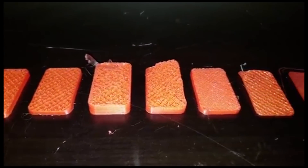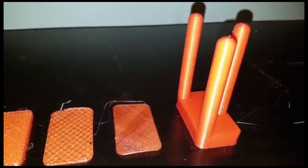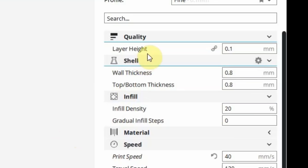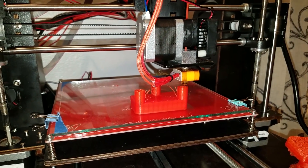I'm typically a pretty stubborn guy, but I just went ahead and gave up on the Chinese software and downloaded an English version, and that ended up working just fine. The most important thing I found is you definitely want to dial your speed down — this helps a lot with quality. You also want to adjust your layer height; a smaller layer height should get you higher quality prints.